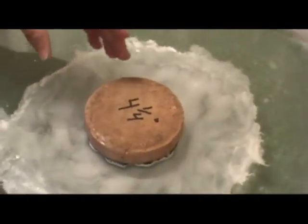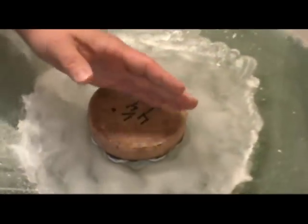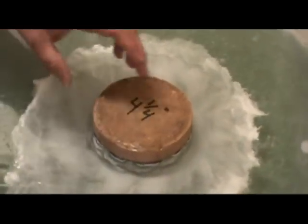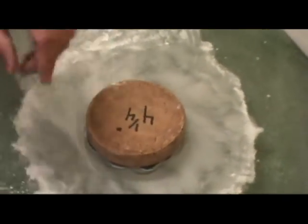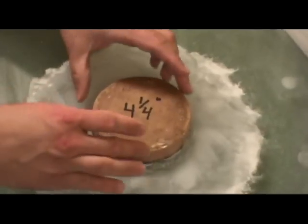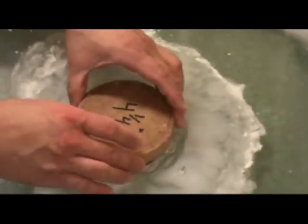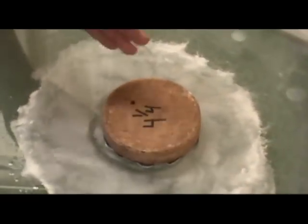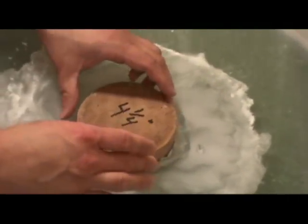In general you always do that with a pitch lap when you're doing polishing — you want to continually use a different diameter of the pitch lap. By having this on a turntable I'm constantly working on a different diameter of the mirror, so I want to present every diameter of the pitch lap to every diameter of the mirror over time, but in a random way. I'm not trying to make any exact angle change; I just let go for a minute or twist it a little bit. It's just important that it rotates in your hand.